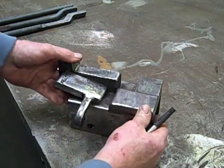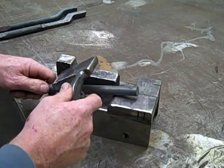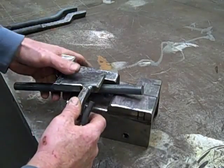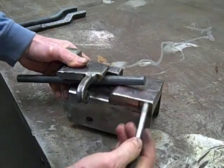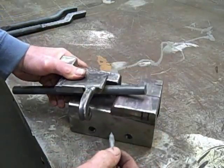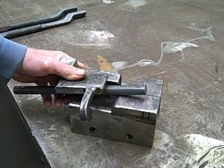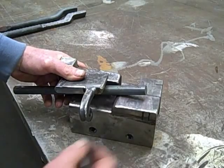As we begin our sequence, the steel is inserted into the jig. If you'll notice there are two marks — they're simply arbitrary — which tells me how far in, or how much material, I want on the working end of my tong. So that determines it.